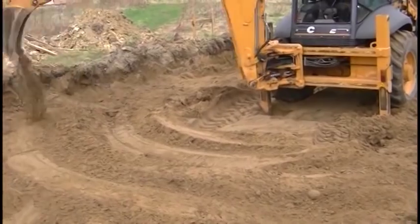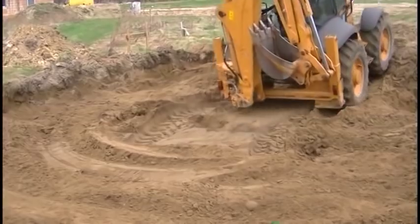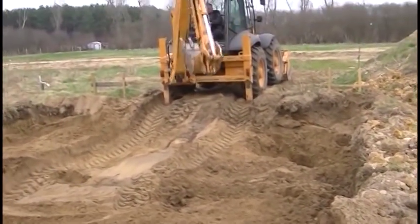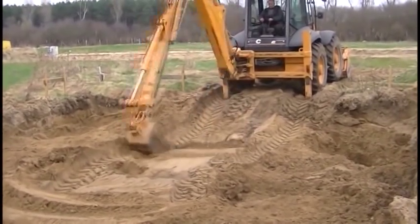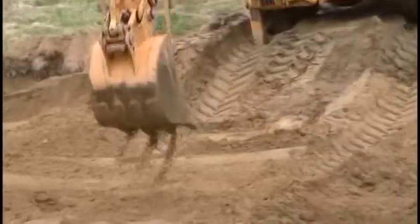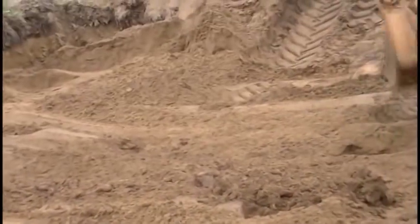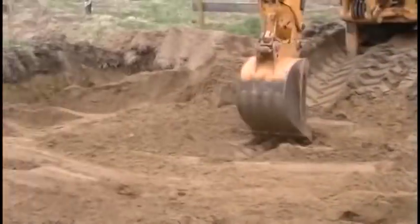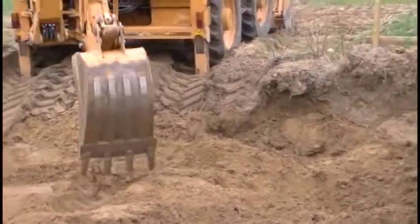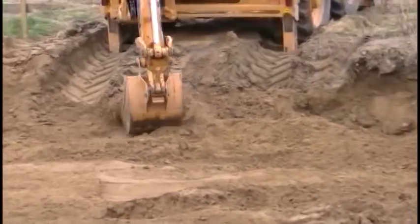In the presented case, after draining the pit, I replaced the ground with an aggregate of 0-3 mm fraction, which is suitable for compacting. This should be done layer by layer depending on the mass of the compactor. The one I used weighed 90 kg, so each layer was up to 30 cm thick. It was only after true compacting of the replaced ground that we commenced making the pit for the strip foundation. I will present the manner of compacting later on during performance of a ground-supported floor.